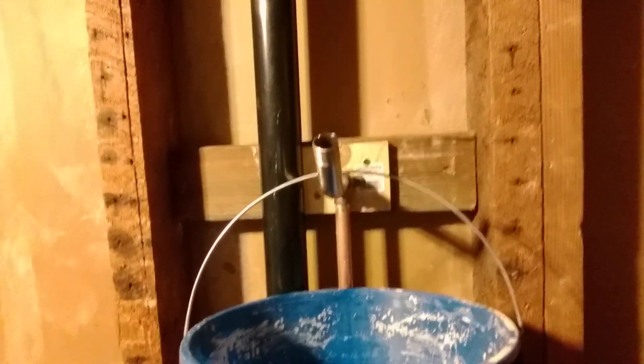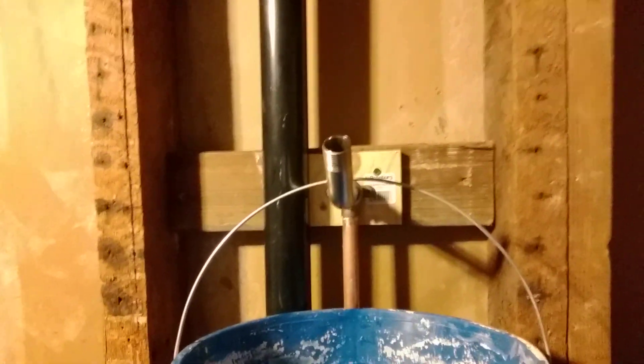Here's the actual three-way diverter valve. I've got these valves positioned on the side wall of what will be the shower, and then it runs across. I've got both pipes going over here to the left — one to what would be the handheld unit, and then up into the overhead shower head rain head here — and I've got this thing just loosely fitted in there and turned around backwards so that I can catch water in the bucket that's up there.